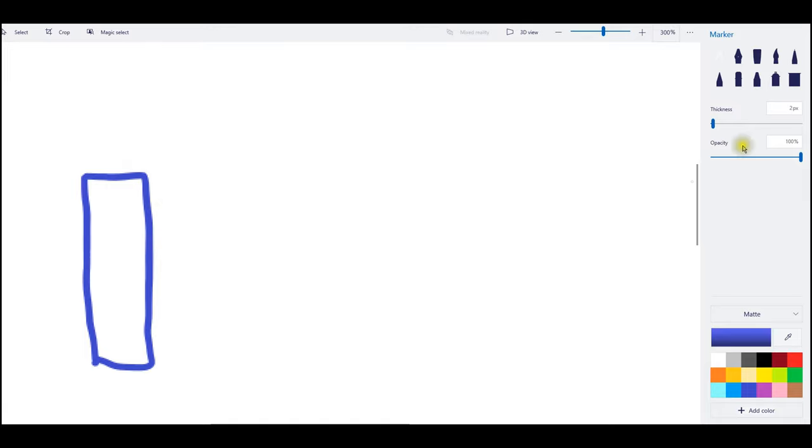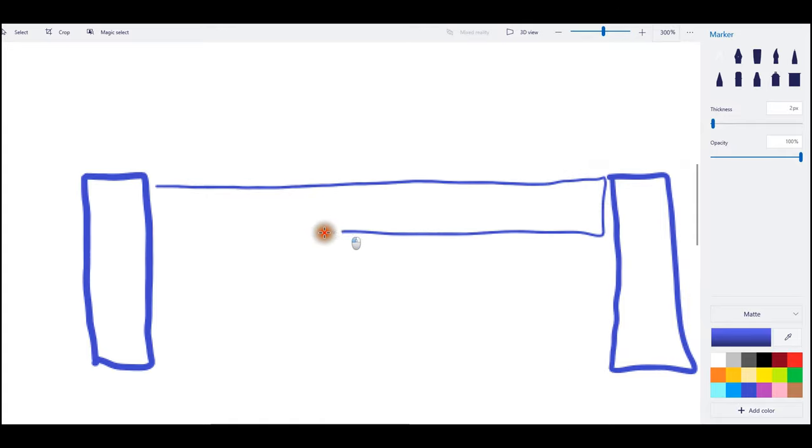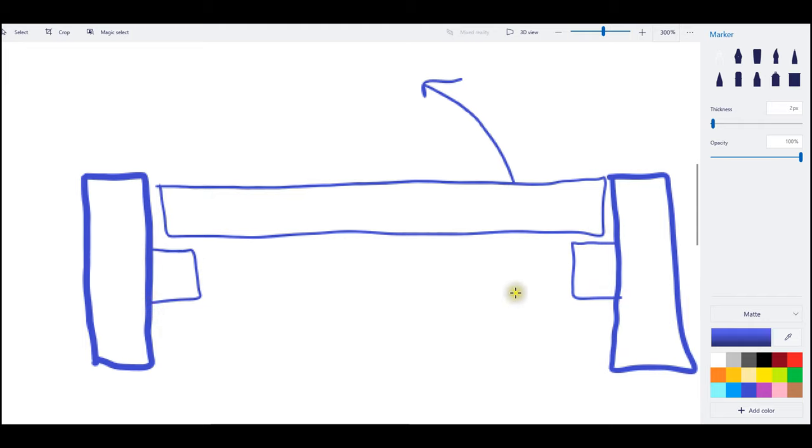The other stop that they're talking about is, you've got your door here. Let's say it's going to swing in this direction. You can't have a stop on the frame here. It's not going to work. The door is going to hit it. For the same reason, you can't have a stop on the header. But you have to have one here. You must. This door is going to leave this direction. This will never make contact. A stop over here is going to be a problem. So you're going to need a stop here, or something to prevent the door from unintentionally moving in that direction. So you're going to need a means to arrest the door from not going beyond a particular degree of open. And you're going to need a means to arrest the door from swinging in the wrong direction.